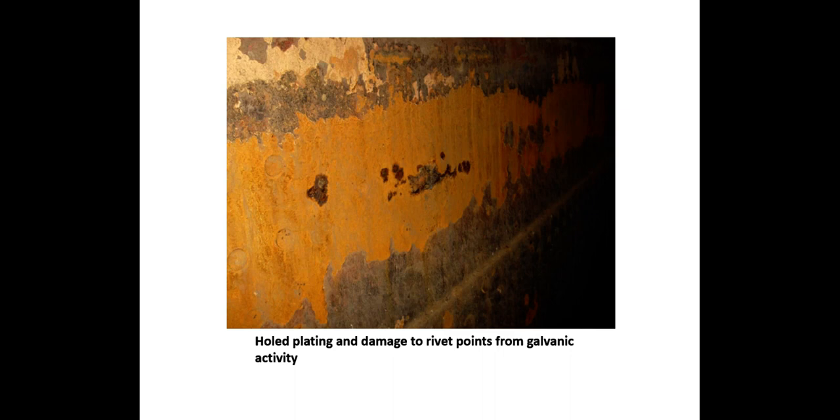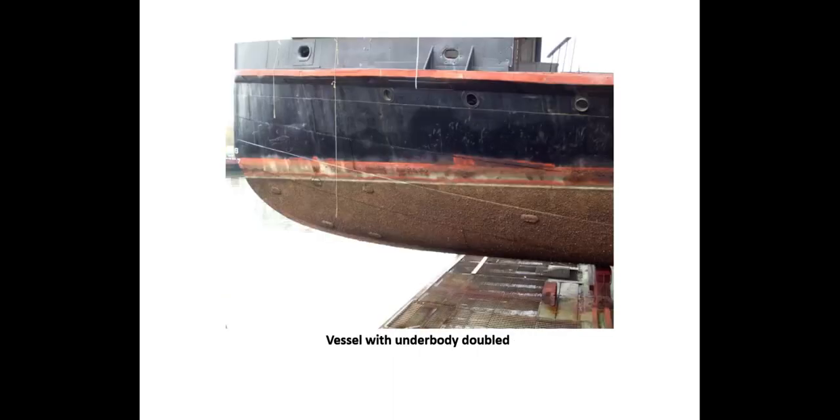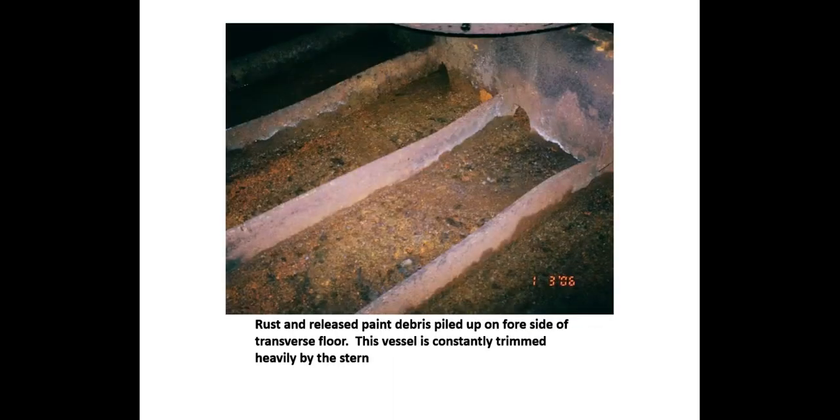There we have some hold conditions on the side shell. These were blown in by a pressure wash as soon as the vessel was raised. A historic vessel is usually at the same trim throughout her inactive life, and this is important to note at the start of inspection. A vessel constantly down by the stern will collect dirt and debris accumulating in the aft end of compartments, piling up against transverse floors and bulkheads — areas that are heavily corroded with corrosion action going on under the debris.